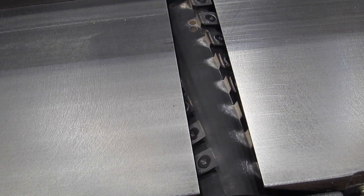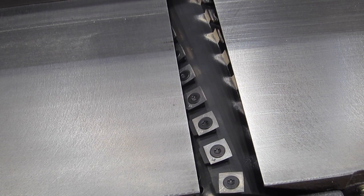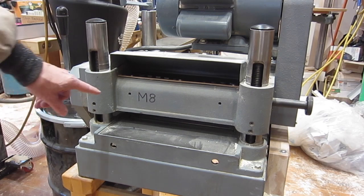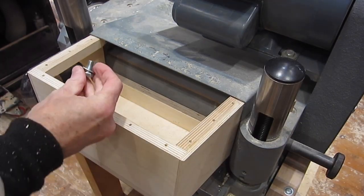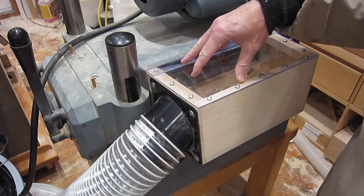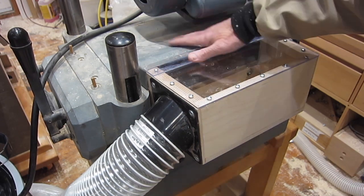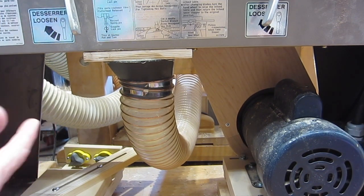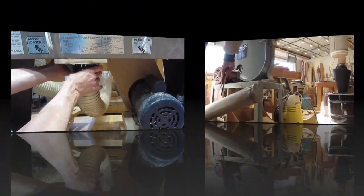If you have a segmented cutter head, the sawdust shavings will be small and flow easily through a 4-inch duct. But if you've got traditional cutter heads with straight knives, you can get fluffy, bulky shavings that may clog a 4-inch duct — so you've either got to go for a larger duct or have a system where you can easily take the ducts apart to clean them. The planer, very conveniently, has a couple of M8 threaded holes, so I made this custom-fitted wooden box that fits in snugly. I needed a removable cover on this box to access the bolts that secure it to the planer, so I made the cover out of plexiglass so I can see shavings coming through. This jointer didn't have any port for connecting dust collection, so I made this piece of wood with magnets on each side and it attaches firmly to the jointer.